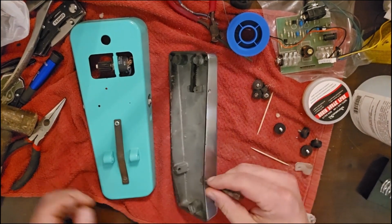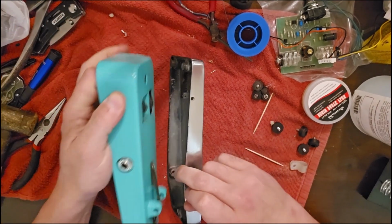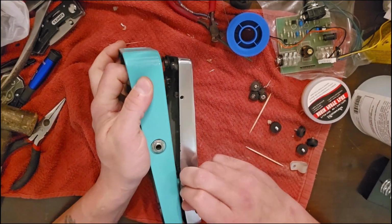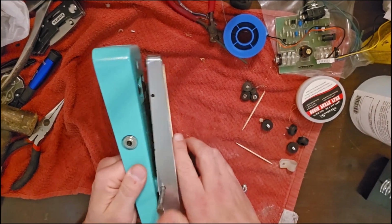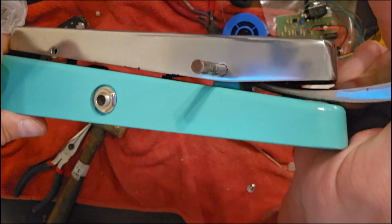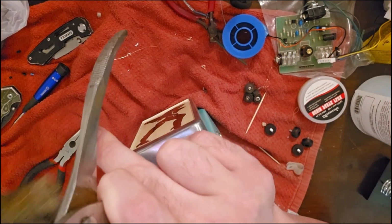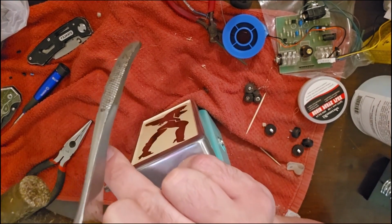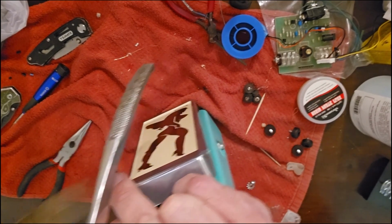And even with that being said, I'm very lightly tapping when you're putting this through. You don't want to be rearing back and going for it. You really don't want to break those posts if you don't have that lined up correctly. So right here, just real quick, I'm showing you that I'm using the grip of a plier to pry that bar up just to make sure I'm not hitting that either.